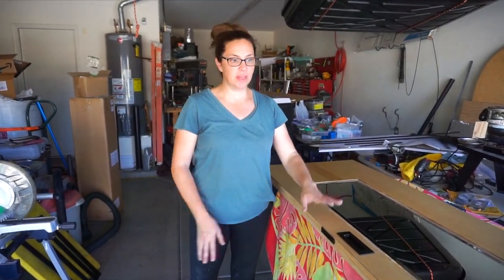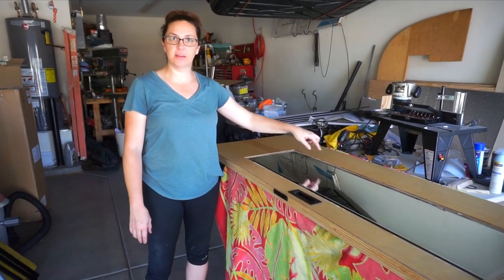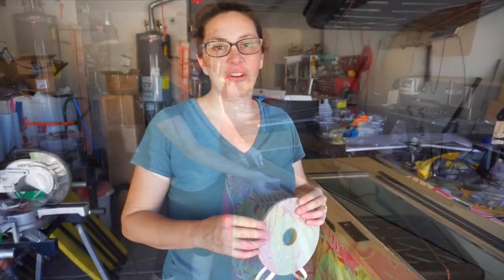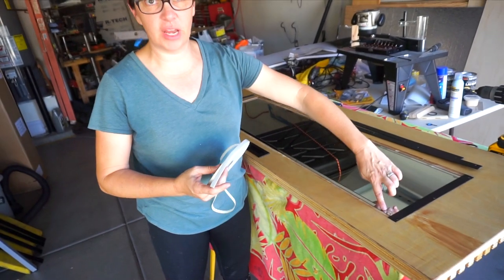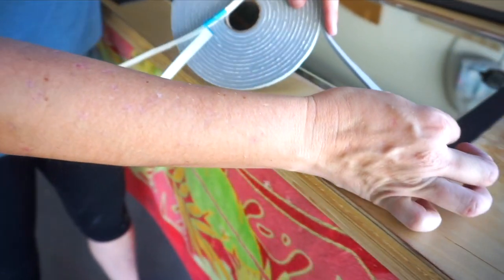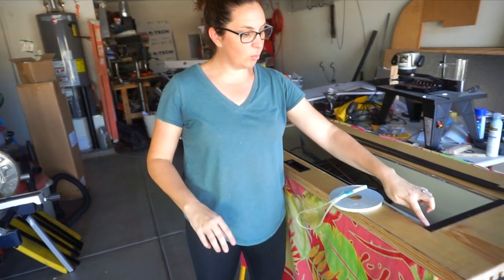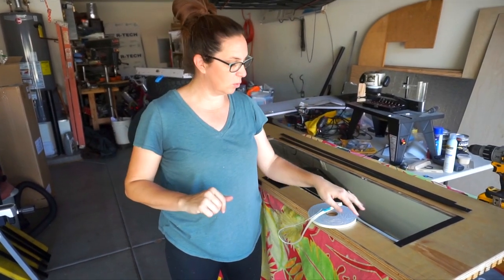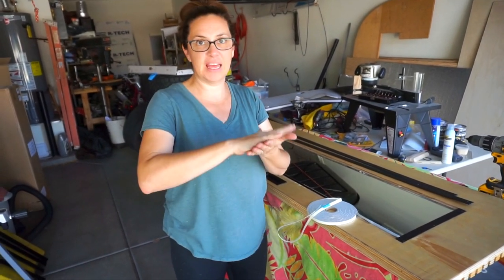So we are ready to wrap up this front door — we've inset the mirror and now we just need to put the black metal framework around it and screw that in. One thing we're doing before we screw down the metal framework is right here where the mirror kind of bevels down, we're putting just some of this little weather stripping material on that beveled part. Because it's foam, the metal will smush it down when we screw it in, and we think that will help prevent the mirror from wanting to rattle around. Just like everything, it's an experiment.